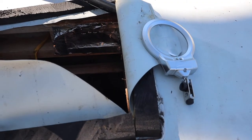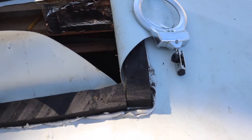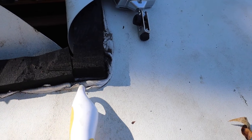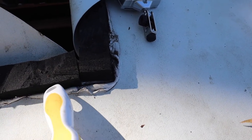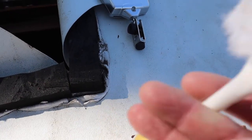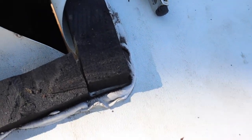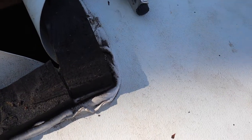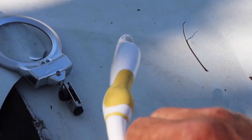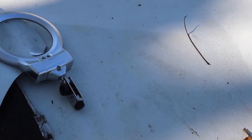Here's an update on the air conditioner leak and what I think happened. There's a joint or seam in the black seal right here, and I think water was getting into that because there were leaves and stuff built up here. Water was running along this edge, going down in that crack - the roofing material is cut to that point. From that point forward, I think it was running that direction, right out onto the plywood and beneath the roof covering itself.